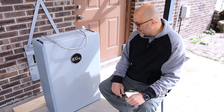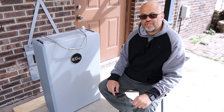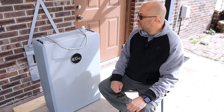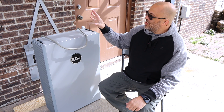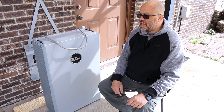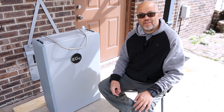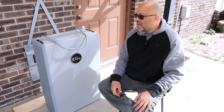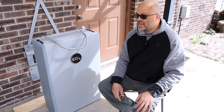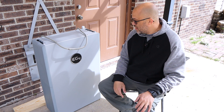I've decided to mount this thing outside — changed it up a little bit. I was going to put it on the inside, but this thing is ready for the outside and it's probably just easier to put it here. I can run the conduit straight through this wall and straight over into a wire way, and have both panels on there with the wire way underneath. I just didn't have enough room to run behind the water heater — would have had to move a bunch of stuff to get conduit to go that way.